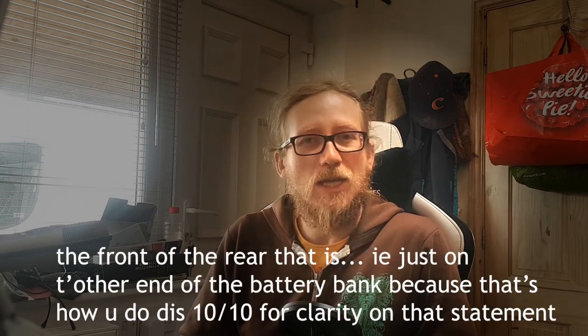The negative is fine at the starter battery end but needs to go a little further since the negative of all the batteries will be at the rear of the van, and the positive has to snake around the battery into a fuse and then to the starter battery's positive. I think one extra meter will be enough. I've also had to order more of my big fat 35mm² cable — that's going to go from the battery to all the sources of power before being split off into smaller circuits. That stuff is about £10 a meter, which is quite expensive.